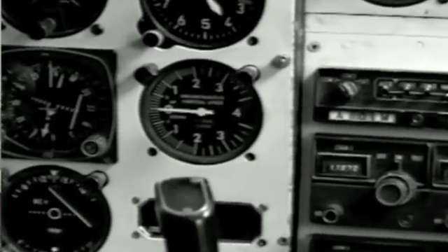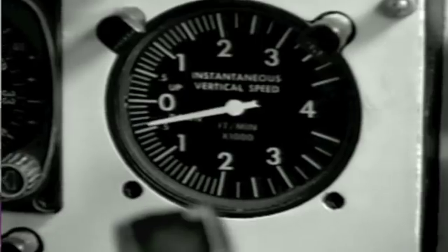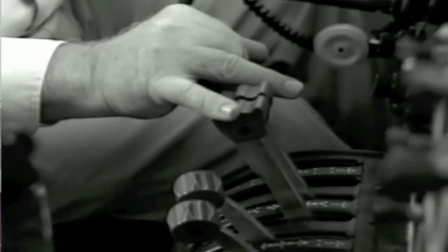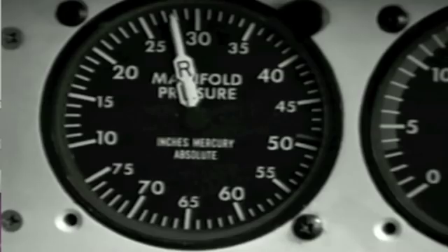Here's how the stage cooling program works. Begin your descent at 500 feet per minute at cruise power. Every one to two minutes, reduce manifold pressure in small increments — two to four inches. Keep repeating this process until you've reached the power setting for traffic pattern entry or final approach. Our main concern is to avoid abrupt large power reductions, so in addition to a safe landing, you'll have a sound engine at the conclusion of your initial test flight.